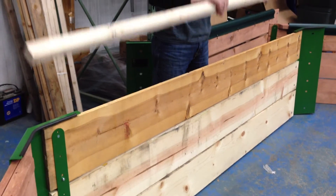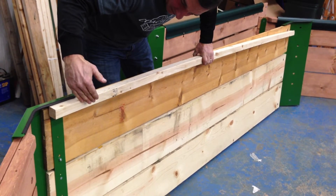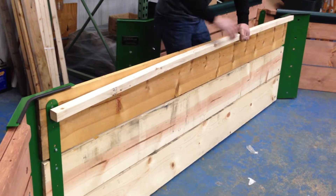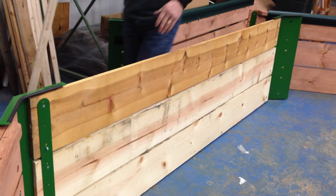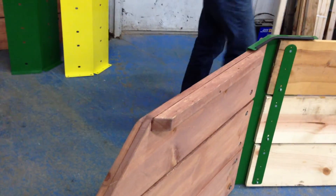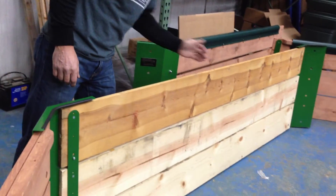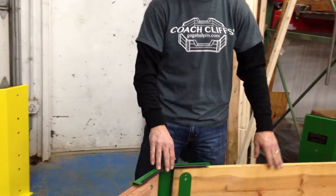The next step: I always like to take a two-by-two strip of wood and first measure the length of it. I'll usually cut an angle right about here so it's not covering that bracket, and cut it a little bit shorter on this end too so it's not covering the bolt. You end up with two-by-twos all across on each wall, and that helps firm up a one-by-ten board plywood. Then I just screw them in with a two-inch wood screw about five or six places along the wall. And then if you purchased wall-top covers, you just slip your wall-top covers right on and follow the instructions for putting those together.